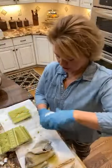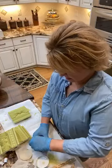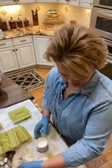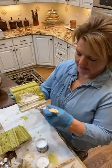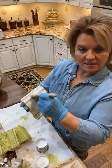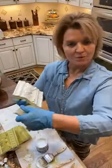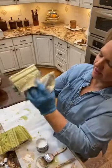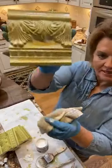Let's talk about the whitewash — we're going to do that one first. This one is going to give us kind of a beachy feel to this color. Any time you're whitewashing something, that's the effect you're going to get, most likely. I'm dipping right into the whitewash antiquing gel. If the comments are in your way, just swipe away with your finger. I'm going to use an old cloth and just remove it right back to reveal the pretty color underneath. You can see it's just softened it down, whitened it down, and you're going to see this pretty soft version of green coming through.